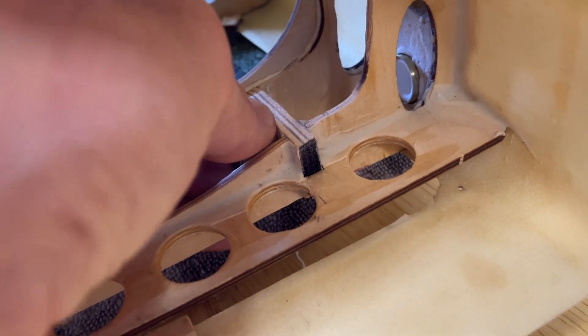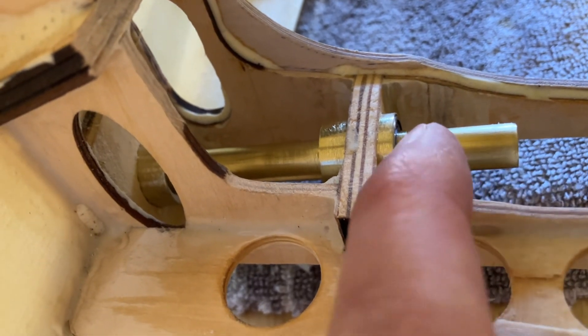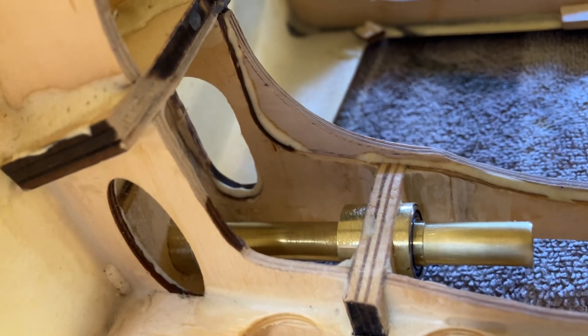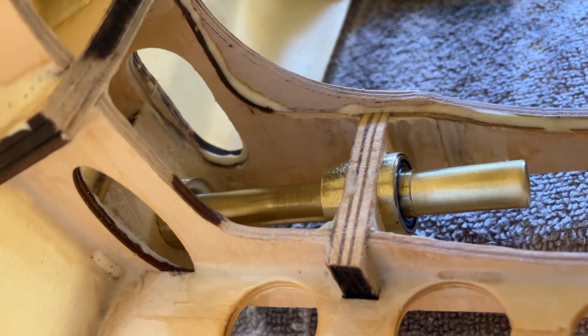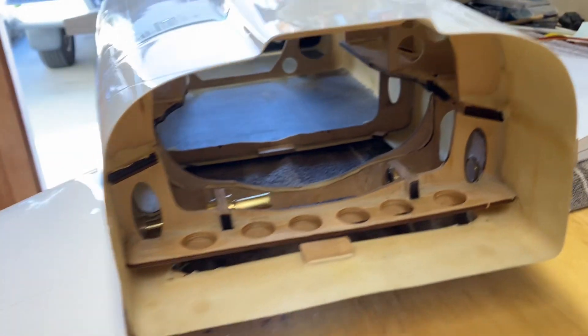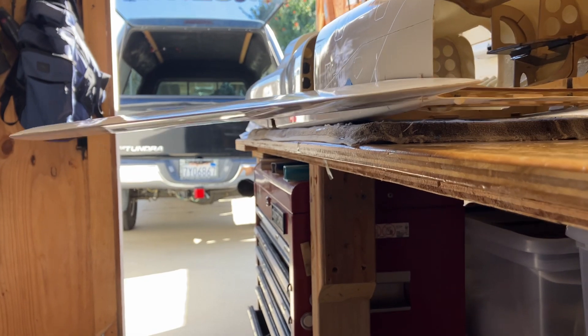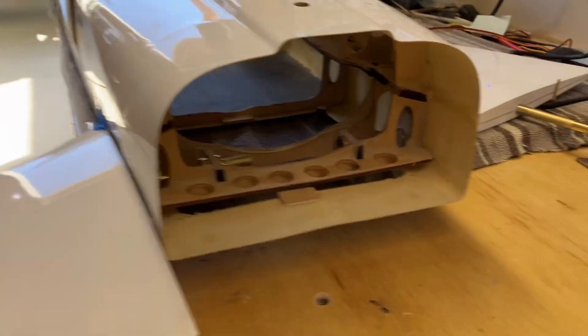I'm pretty stoked on this setup — glad to not be dealing with bushings and any potential friction or slop. You can see the actual elevator is installed over here, and eventually there'll be a collar that mounts on to lock it in. The bell crank going here would probably lock it in well enough that I might not even need an outer collar. The main redesign is basically done now. The elevator is installed, though I've got about a degree too much anhedral — it's not sitting quite level — but that'll be an easy fix, just high-spot the top of these holes and re-bore it down a bit.